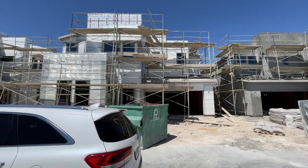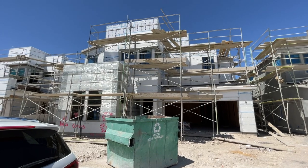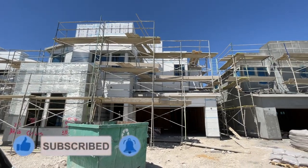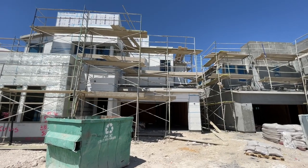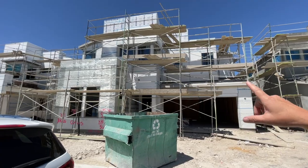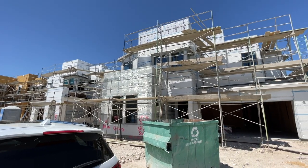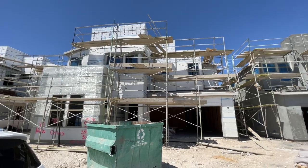Welcome home. This is your exterior elevation, currently being dried in with the lath and the light roofing material. Getting ready to set more roof tiles on your lower garage, getting inspections in the next day or two on the electrical and mechanical plumbing. The section of lath that is a different color over on this side is where your stone is going to be for the 3D elevation. It's a heavier metal with more nails to hold the stone up. The rest of it is a soft backing for the regular stucco.